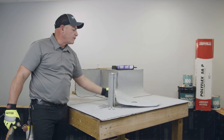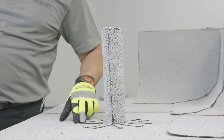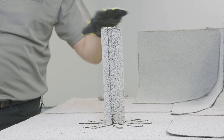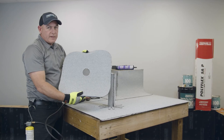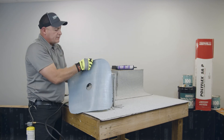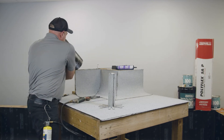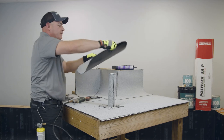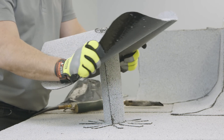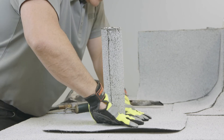You can start with your second piece — your target — that will fit over the plumbing penetration. You want this piece to extend beyond the finger flashings another four inches, so basically you're looking at eight inches from the edge to the center of the pipe. The piece has already been cut with a hole for the plumbing stack right in the middle. This also has a release film, so you're going to want to take that off and slide it over the pipe, then sit it in place.